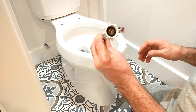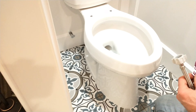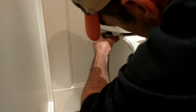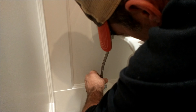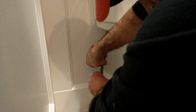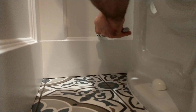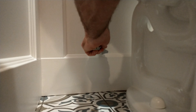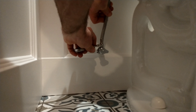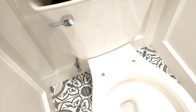The final stage is to hook the toilet up to the water line. The hose being used has a compression washer on it, so plumber's tape is not necessarily required — in fact, the hose actually says no plumber's tape required. Some hoses do require it, so check the instructions before installing. He takes a wrench and tightens down both connections before turning on the water main shutoff valve. With the water turned on, the toilet is now being filled up for its first official flush.